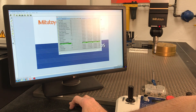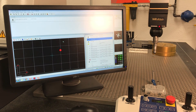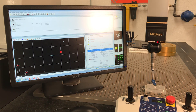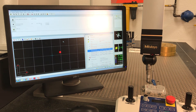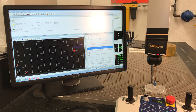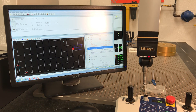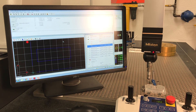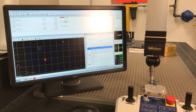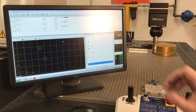Save it, run it again. I don't want to rewrite the whole thing for one mistake — if I had ten mistakes I'd rewrite it, but for one I'll just edit and fix it. That's going to tell the tale after these last four hits. There we go! It was a little convoluted — it didn't have to come up that far — but I'm just testing. If I want to tighten it up I can go back to the editor and change that one inch to 200 thousandths.